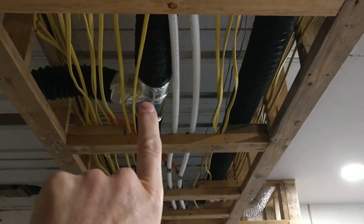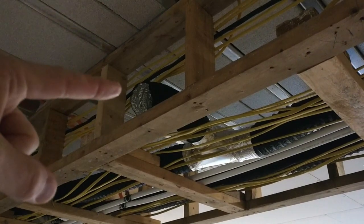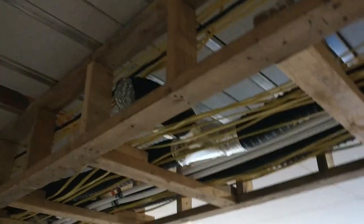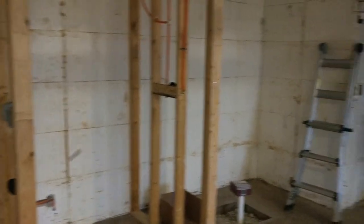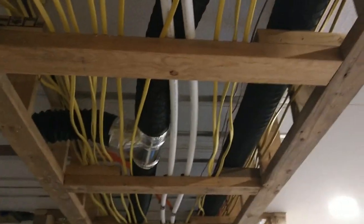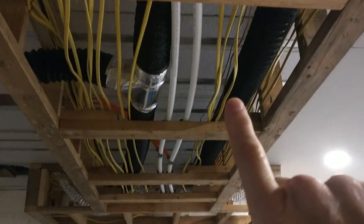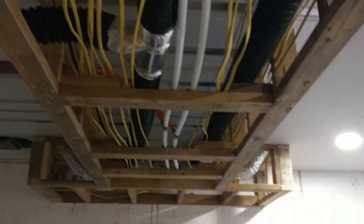What I have here is my shower, toilet, and washing machine. And so this one will come out of this soffit right here, or I should say the fascia part of it, right there. And so we'll be pulling the air all from this side right here. And then the other pipe is the pipe that is the fresh air, which is going this direction. Now, I wanted a little more separation. Instead of putting it right there, I've put it over here.